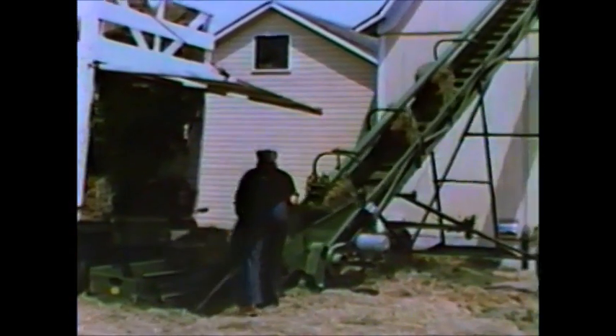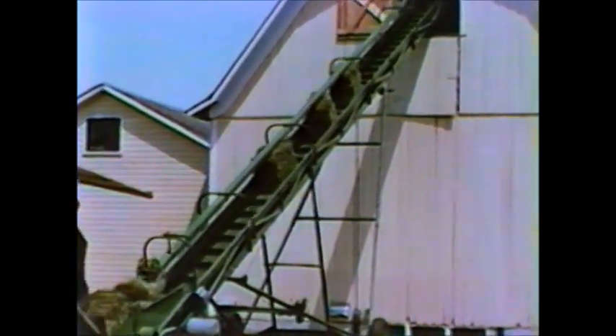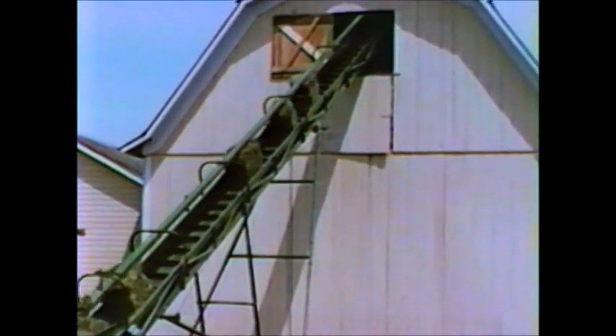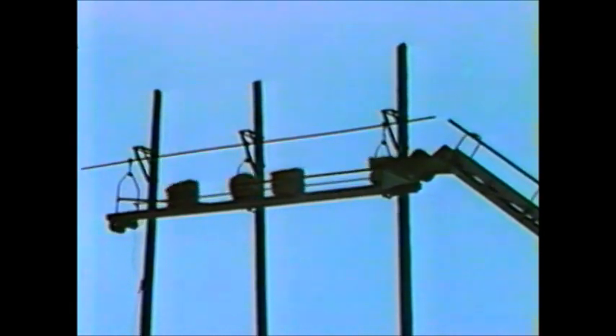Here's the only time you touch the bales until they're fed to your cattle. Because they're half size, you can handle them with a pitchfork. Here's a demonstration showing what goes on inside the barn. The new barn conveyor distributes bales through the full length of the mow. The conveyor is hung from the hay track or ridge pole in sections to fit your barn. By simply crossing the guide rails, you can distribute bales at ten-foot intervals to the left or right side of the barn. Short bales require no stacking — they tumble automatically into place.